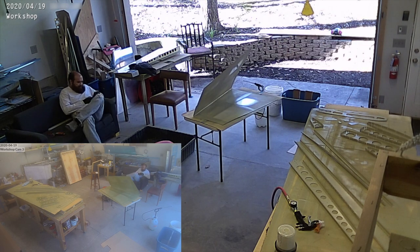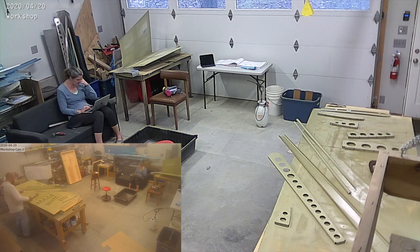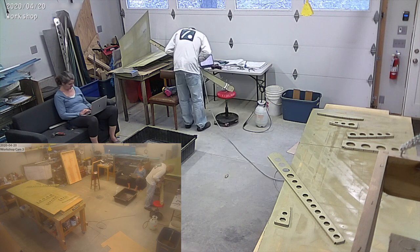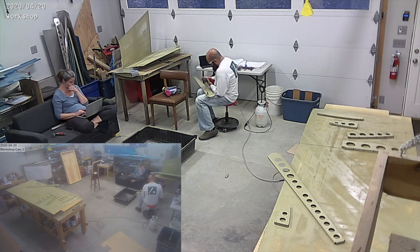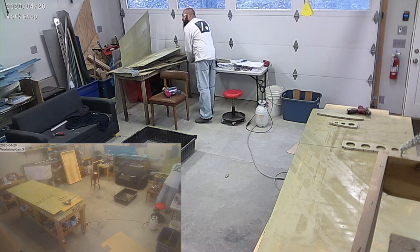You give them a day before you start. You can then assemble. And then you assemble with rivets. Most of the time they are squeezed rivets. You'll see me using the rivet squeezer there. It's the red thing that's been on and off my hand there. And you rivet everything together, and then you have a part.